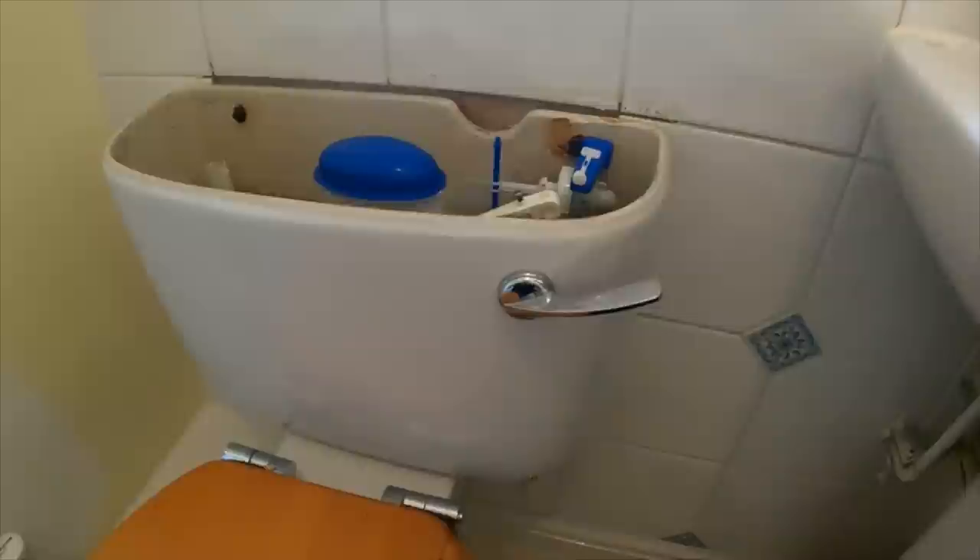So I picked up an adjustable Hydroflo telescopic float valve. We're going to whip this one out - which is exactly the same as that but not the adjustable one - and hopefully this telescopic one can drop down those 10-15mm to get under there. Get the water off, drain it out with the AquaVac and get that one on. It's just niggly little things - toilets can be such a pain. A simple job of doing a ball valve has got so many different variants that can cause an issue. There you go - that's the new telescopic one in. We've popped back a week later and the lid sits perfect on there now. Pushes fine, brass bottom, brass tail on it. Job done.